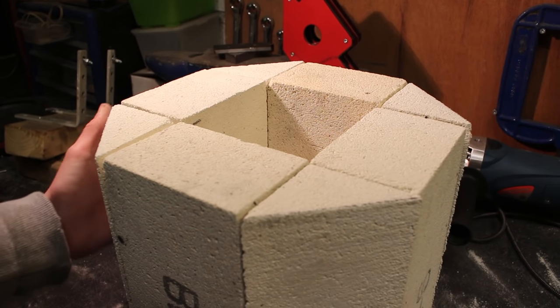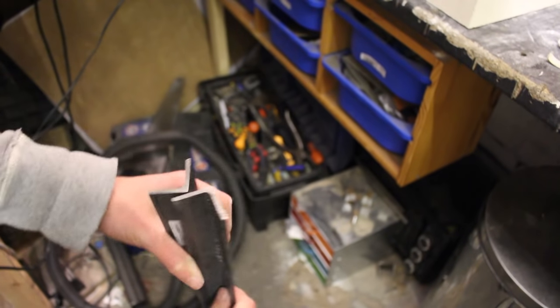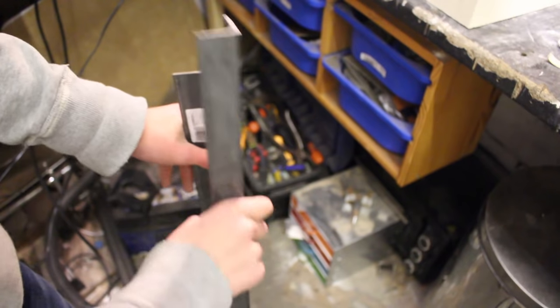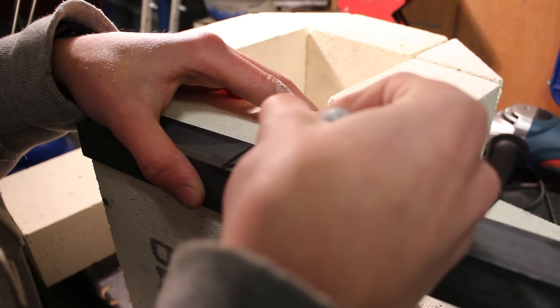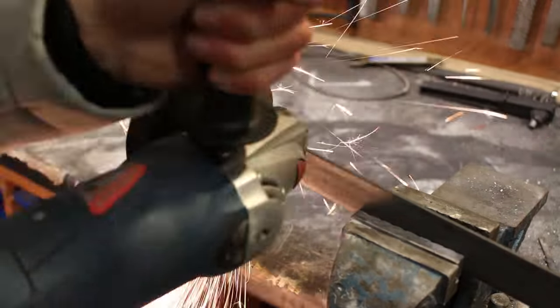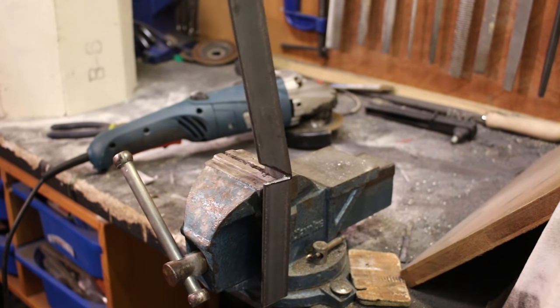This brick is really soft and easy to break, so I need to create a steel frame going all the way around it to hold it together and strengthen it — I'm going to use 90-degree angle iron for that. It's about £10 per meter. I mark the length and 45-degree angles, cut with my angle grinder, then use my bench vice to bend the metal to the angle I need.